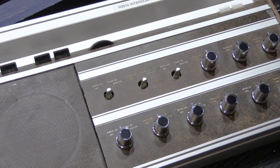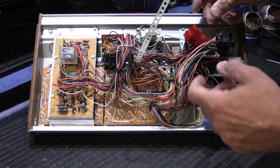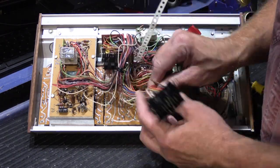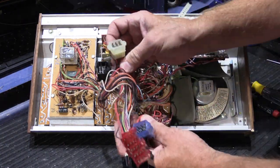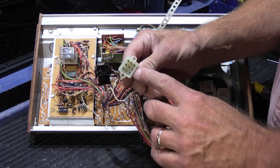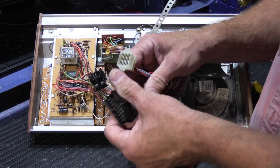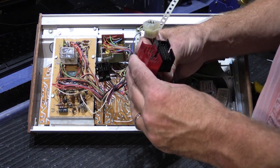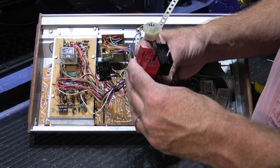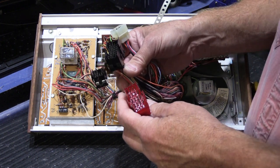So now I'm going to take off the rest of them and then we'll flip it over and look at the back. The back side of our 2510, and as you can see, there's a lot of stuff going on back here. Working from one side to the other, we'll start in the middle first. You have all of these giant bundles of wires here and here and here and here, and don't forget this one. There are five of them, and they all have these large, differently shaped Molex connectors on them with the little pins inside, and these plug into the terminal board that's inside the wall housing. Each one of these is a distinctly different size, shape, and color, except for these two maybe, which could possibly be the same, but one's red and one's black, and the sockets are color-coded, so you'd have to be off your game to mess up that one.